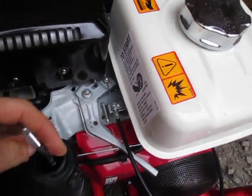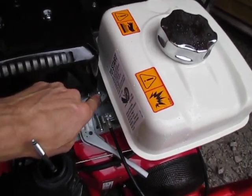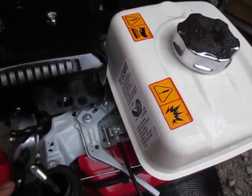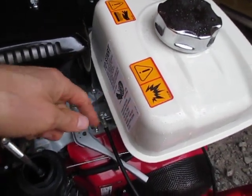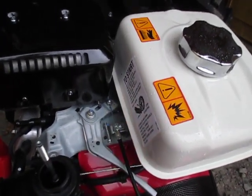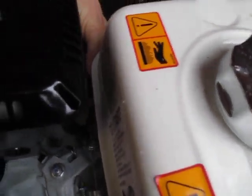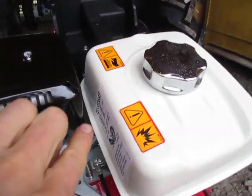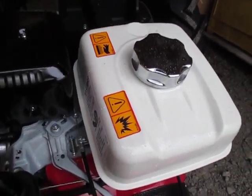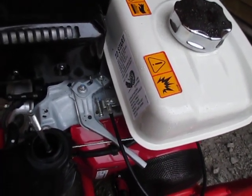On the Grillo tractors, for example, this whole procedure is the same — they use an Allen head bolt in the clamp, and the body of the clamp itself is a hex shape so you can put a 10mm wrench on it to hold it in position. Let the spring pull it fully back to idle, thread the new cable through, grab the protruding end of the cable which projects through the clamp down here under the muffler, and pull it with long-nose pliers. Pull all the slack out of it, then tighten the bolt on top of the clamp to pinch the cable in place — that should give you the proper adjustment.